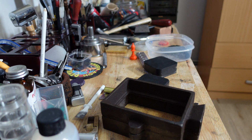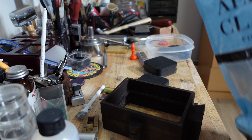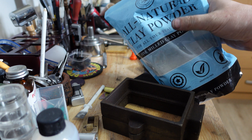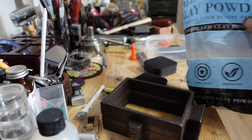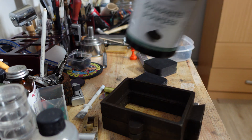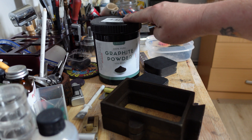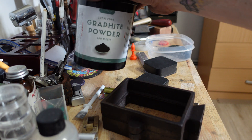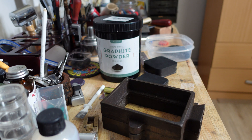So the sand is almost 400 times smaller in grain size. The next material I sourced was clay — again the same ingredient in regular sand casting, but what I sourced is a micronized clay powder, also almost 400 mesh. The third ingredient is graphite powder. The product I made is actually primarily graphite powder, and this too is 400 mesh. So it's no longer even sand — this is powder. All of these ingredients are a very fine micronized powder, and I felt that would solve the texturing issue from the sand.